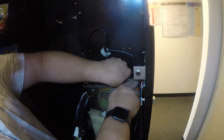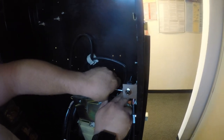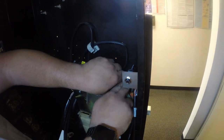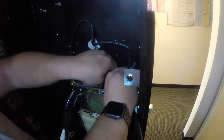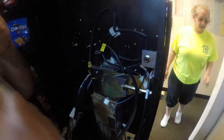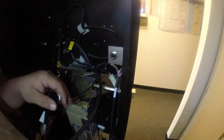Specifically, the keypad adapter cable, part number 11-1700-20. If your machine has the pound and the star key, it will have a 13-pin keyed connector which plugs directly into the controller. Also, you will have a 10-pin power cable with pin 6 keyed, which plugs directly into the controller at J1.